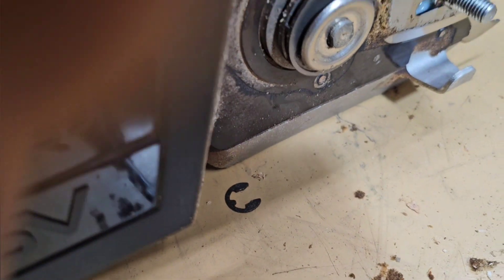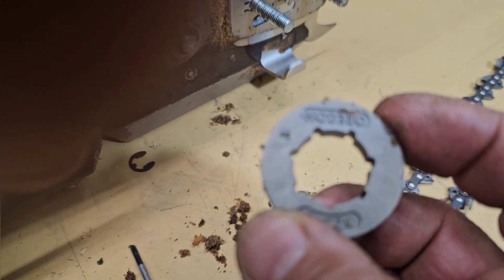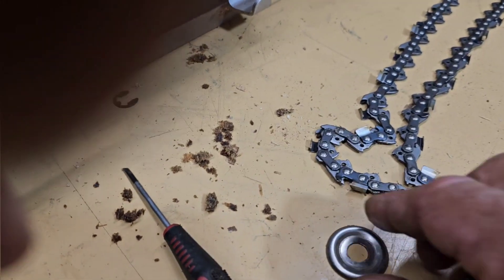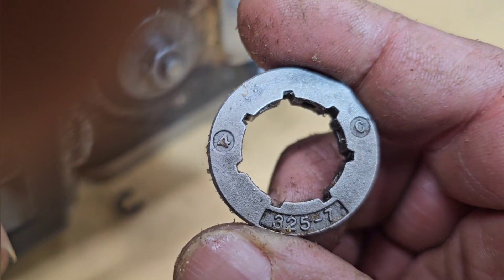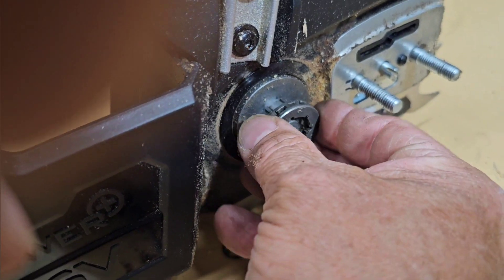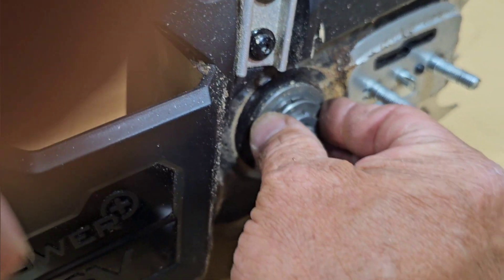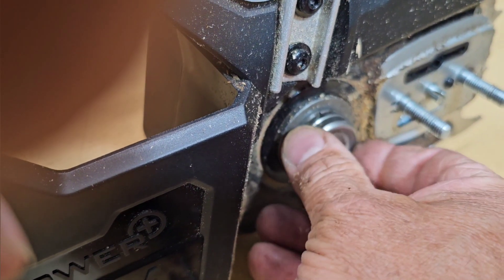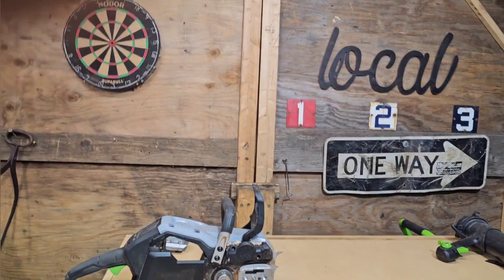That came off without shooting into the distance. We'll take this big three-two-five eight-tooth and swap it out for a three-two-five seven-tooth, and that's going to change the diameter enough so we go from a 30 meter-per-second speed to about a 25 meter-per-second speed. I'll probably need both hands to put that back on, so you get the idea from there.